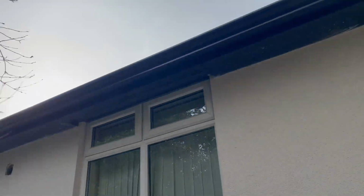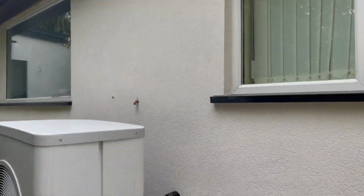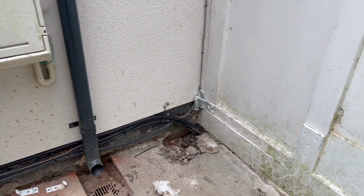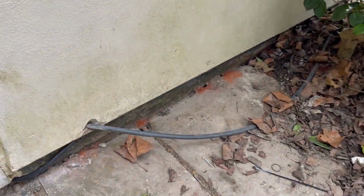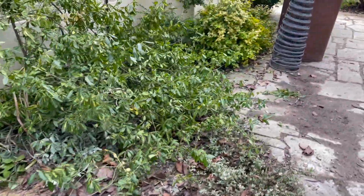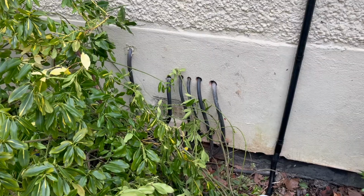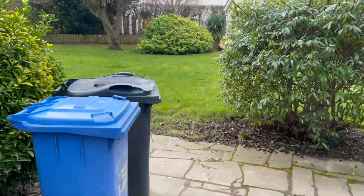Yeah, so the panels, it is having panels. It's a flat roof just here, and there's one in the front. I'll show you that. AC run just comes down over the other armoured cables. That's not our armoured. Ours is clipped right under here, so you barely see it straight along. It goes in where all these cables go in the floor. Earth rod's just there, straight into the meter cupboard.